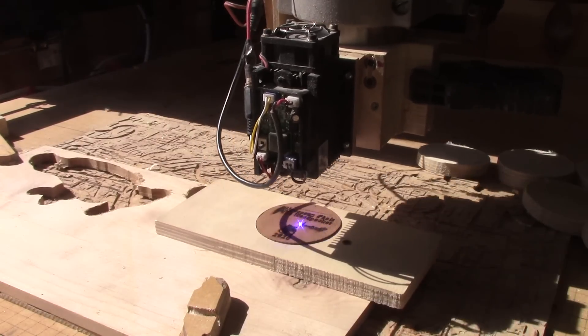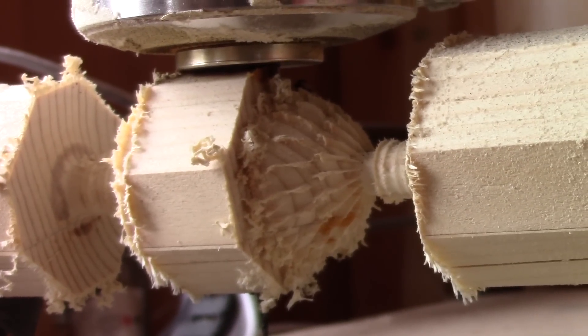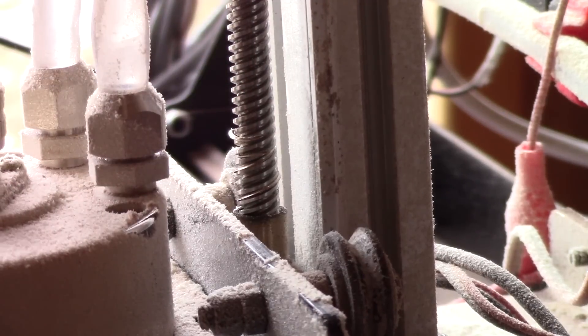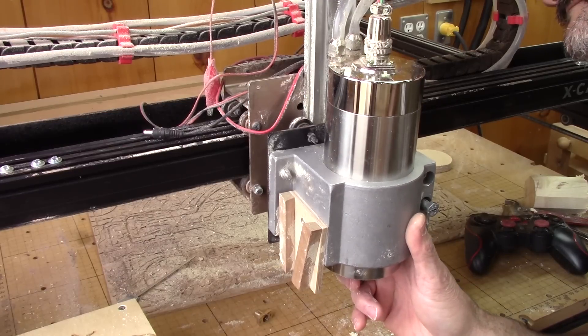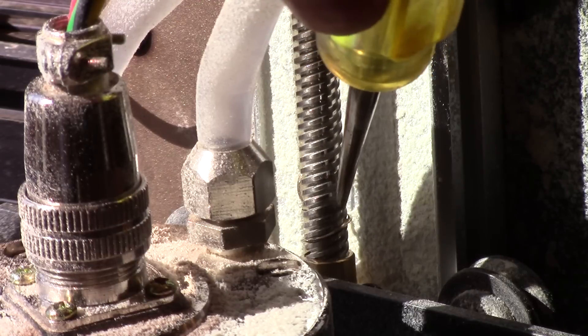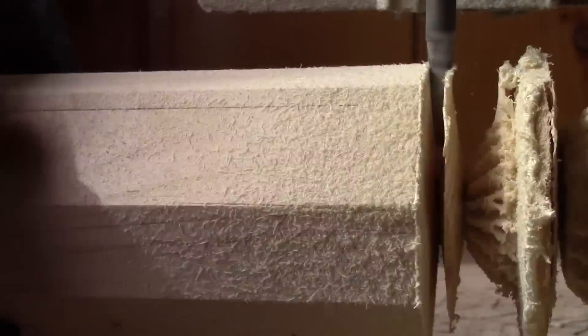Now it's time to try the laser — this works really, really well. But when I try to make a test with my fourth axis, I have big problems. The bit went through the carving and I'm left with a bunch of burnt wood dust. All this because the brass nut I used stripped — it lost all its threads. I said to myself, this may just be a random failure. So I used another one and it happened again — this time I damaged my table on top of the router bit. It's obvious that the nut stripped. This must be the reason why the original was made out of plastic. I ordered some and I'm waiting to receive them. But before it broke, I still had time to make it work for a good 36 hours, and I made this wooden egg.